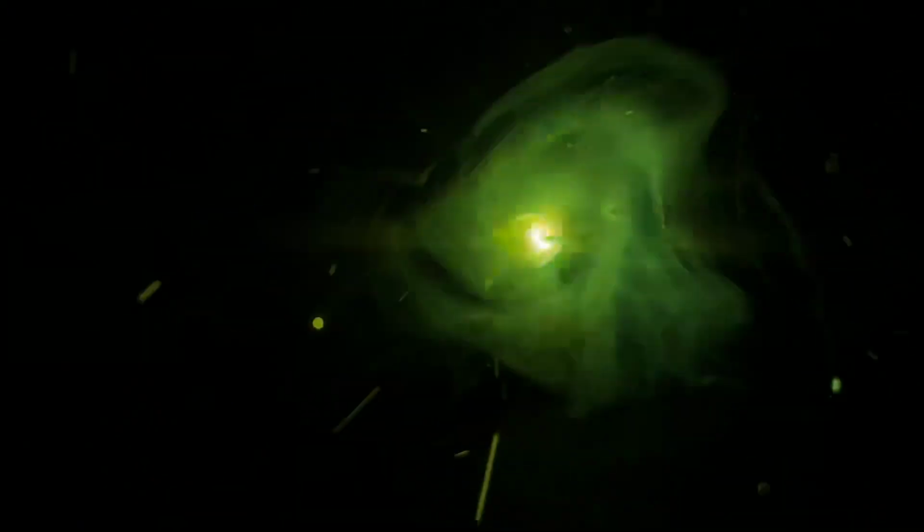My tie-in went better here. I went backwards, filled it in, and then moved forward. But you can see that's the molten puddle. You just want to drag it slowly. If you don't oscillate, just drag it slowly along and let it fill.